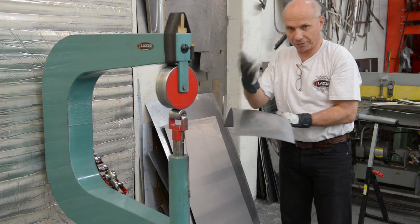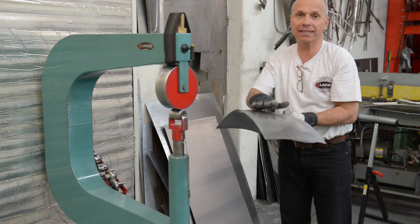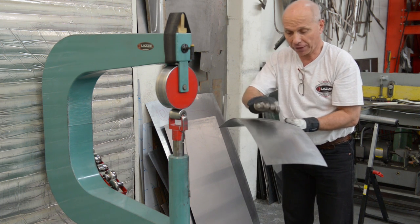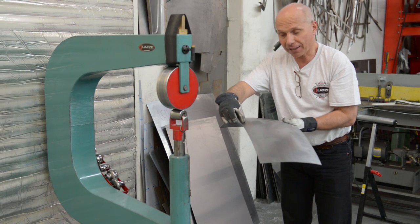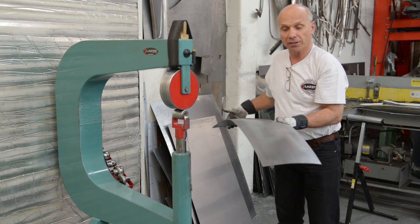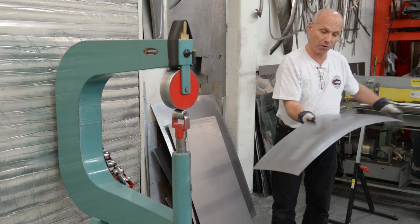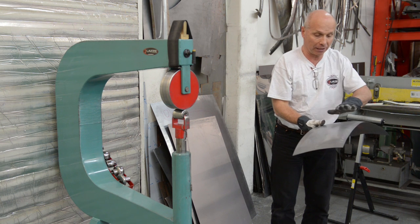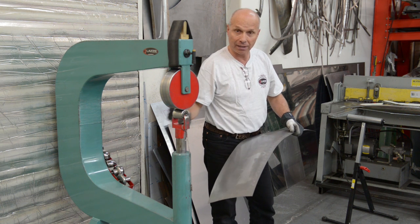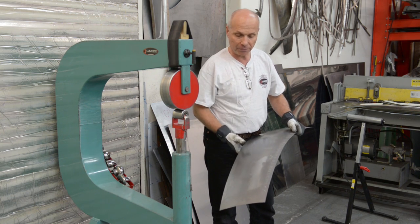If for some reason — or if you do it at home — you raise this up too much, let's say you have too much pressure and you raise this up too much, you can always go over this edge and roll this edge over. Because if it's too high here, it means that the edge is short. And if you roll over that edge, it's going to be more like this instead of this — that will change that. So now you have more of that total shape there. If I want a little more of this curve now, I can always go back to the rubber band and the second wheel and curve this down a little bit more, and I think I should do that just for practice.